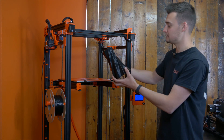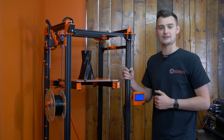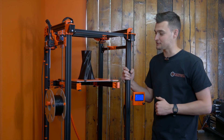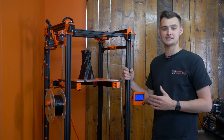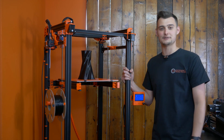We also have a range of other colours and different materials depending on your project. This print took around 90 minutes and I'm really happy with how fast the D-Bot handled that print time. Using a 0.4mm nozzle, this could have taken anywhere up to 10 hours of print time, but using the Super Volcano was able to speed up this process greatly.